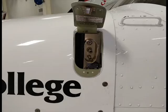The ground power plug is the only part of all of this that you can see with the cowl on. On the round dials, you need a screwdriver to open the access door, but on the G1000s, they use a finger latch. When you look at the ground power plug, you will notice two big pins to transfer a huge amount of power to the battery, and a much smaller, shorter pin that will supply a much smaller amount of energy to an external power relay that will connect the big positive pins to the battery.